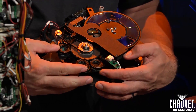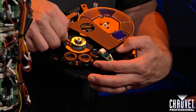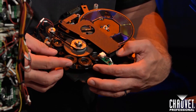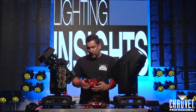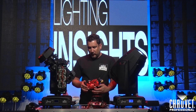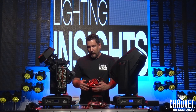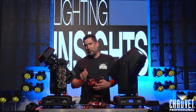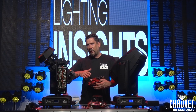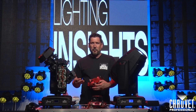You can also make sure that your individual gobo wheels are rotating freely, either by moving the belt or by moving the gobos individually. All of your gobos should move at the same rate at the same time. Check all of your springs to make sure they are all seated and that your gobos are not wobbling. If your gobos wobble they can be really difficult to focus, and the focus will slide in and out because the gobos aren't seated evenly — that's really obvious in your production, so it's pretty important to check.